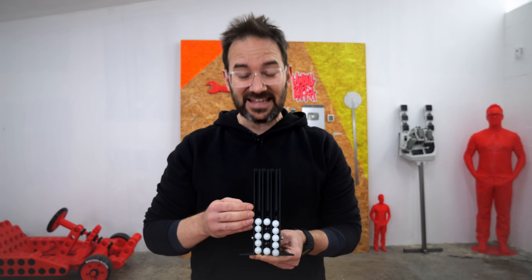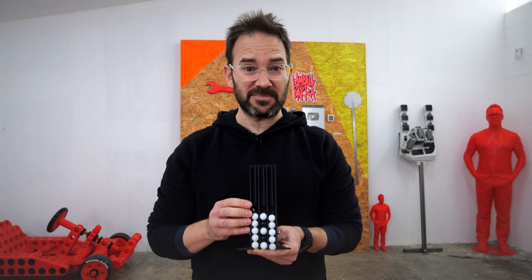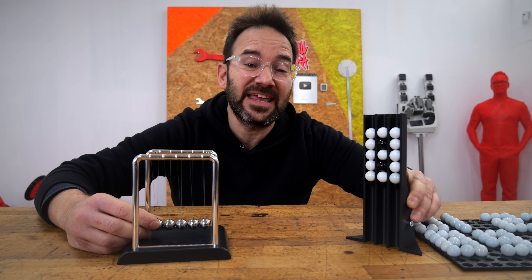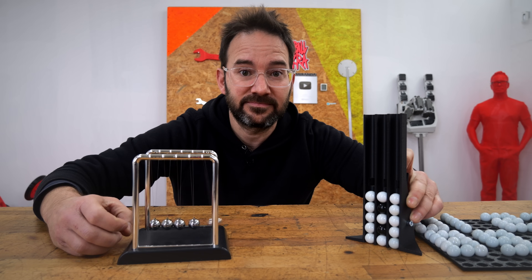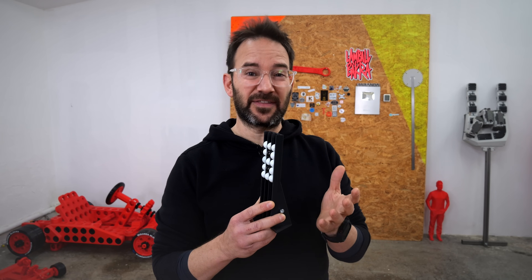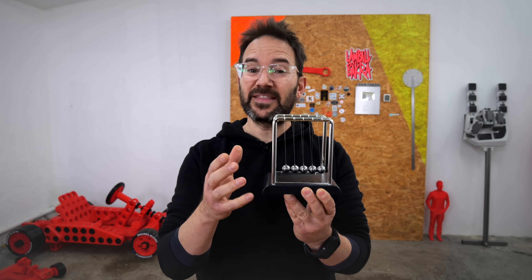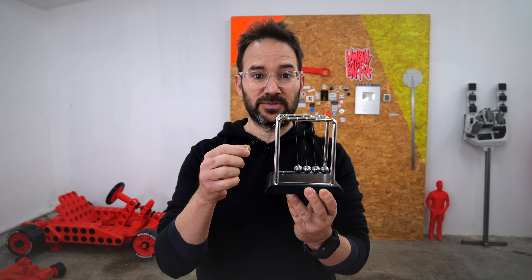Vertically, we have nowhere to go. The digits are as short as they can be, and unless I finish my gravity controlling machine, we cannot make them go any faster. More reasonable than sending this to Jupiter would be to stop thinking about up and down, and start thinking about back to front. The idea is to pre-select all the marbles for the new digit at the back, and then replace all the marbles at the front in one single strike. The best way I found to do this is to imitate one of those toys where the kinetic energy of one marble is transferred to the next.